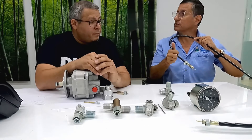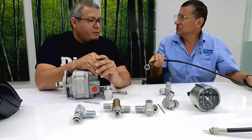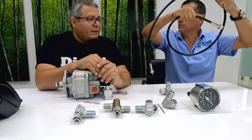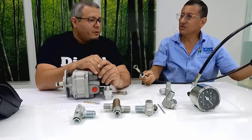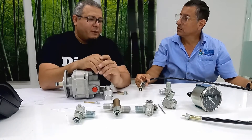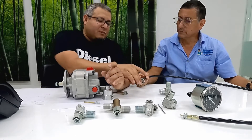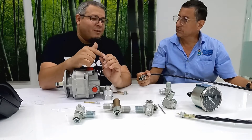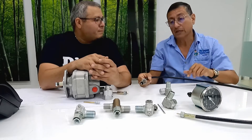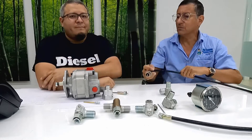What about the bending radius — what is the maximum radius you can bend these cables? We don't recommend bending the cable at all — keep it as straight as possible. You can use some curves, but not bent that much, because this cable is turning and you don't want to create additional friction beyond what is already happening. That's important, guys — because you create resistance and you will probably damage the cable.